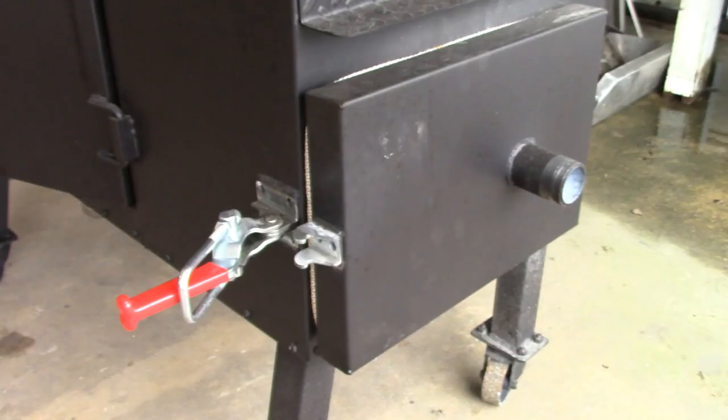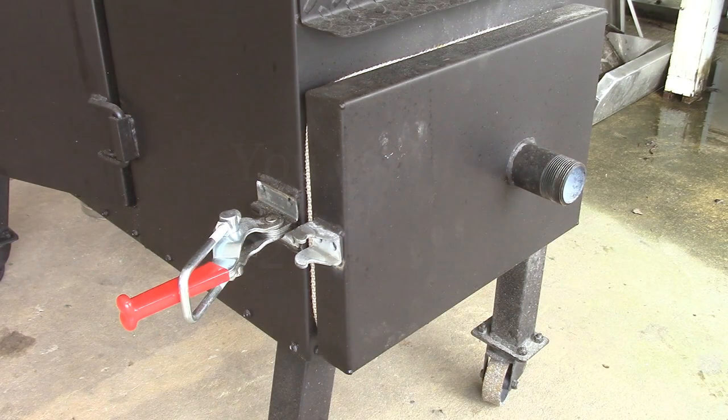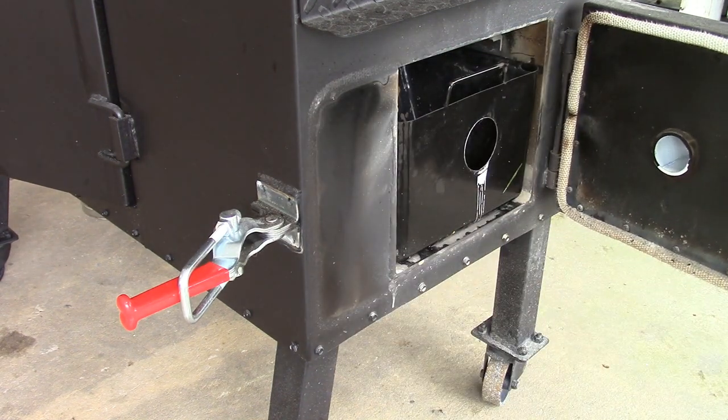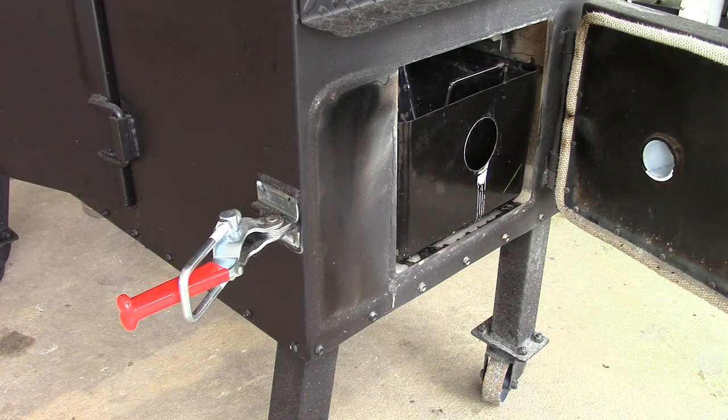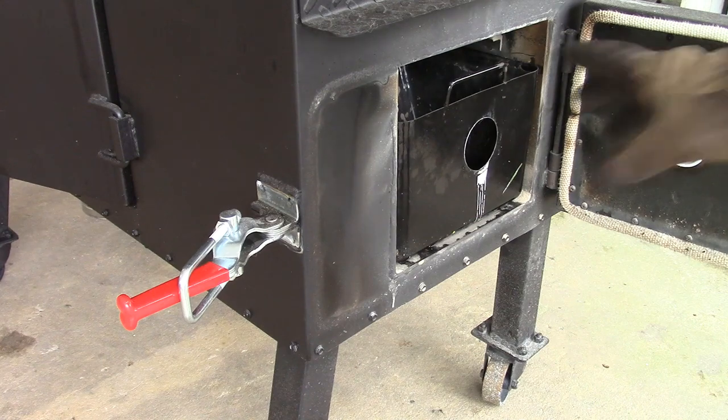I was lucky — I had what I think is called an electrician's punch. It's two pieces that as you tighten them it's got a cutter, not like a hole saw. I made it a little bit bigger — I think it's one and a quarter or one and a half inch. I went just a step bigger since I only had two punch sizes. That actually worked, and I got the other side cut off too.